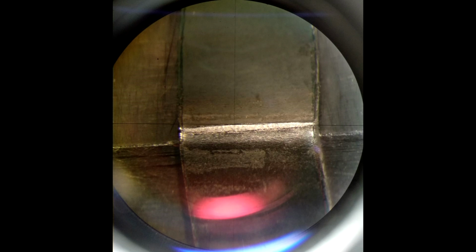And another thing to consider, here in picture 3, I used a scribe to put a scribe line into the material and used that as an orientation for bending. Don't do that. The material will break exactly at the scribe line, because the scribe line is basically a stress riser in the material, and it will break, especially in hard materials like spring steel. Or less ductile aluminium alloys will also crack at a scribe line. Use a soft pencil for layout on bent parts.